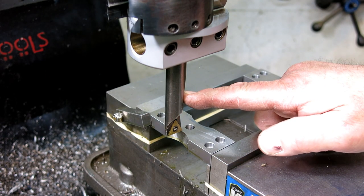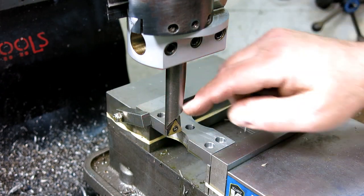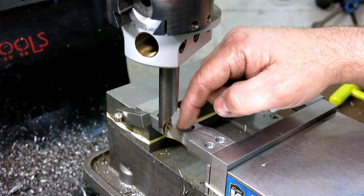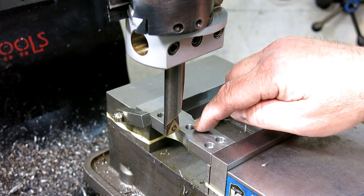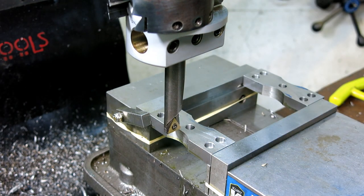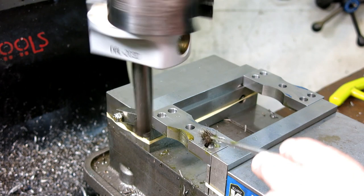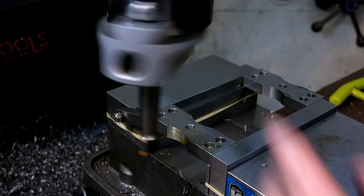The way you set the radius here is, you know where the spindle centerline is. So you move off of a known edge that's a zero datum, and then you run the boring tool over in neutral like so, and you adjust the boring head until you just scratch a line in some Sharpie, and then you know that the radius the boring head is sweeping is correct. Now we're positioned over the center of the desired radius, and you can see it's going to take a little cut right there. I'm going to try it in one shot and see how it works. Put some cutting fluid on there and a little more speed. Let's see how it behaves.